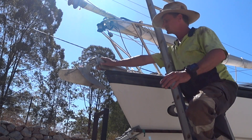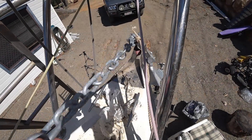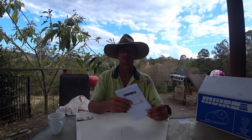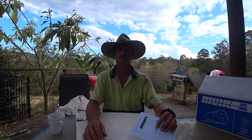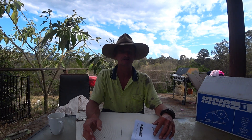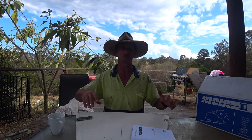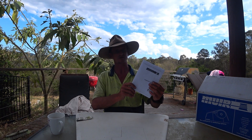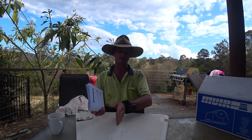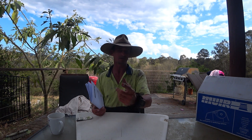So what we're doing first off is I'll be removing the anchor and clearing out the chain locker — that way it'll give us freedom of movement. Now I've taken the hatch off, it's important to have a quick look at the instruction manual. I know, guys, I hear you — it's not part of our forte. I know when myself and my wife do flat packs, she reads the instructions and I do the screwdriver and whatever else. She's at work today, so I went through the instructions. That's how I knew that where the anchor goes onto the front roller, it's got to line up with that cog — the drive wheel. With Muir's, and I imagine most winches, they come out with a template, which is very handy.